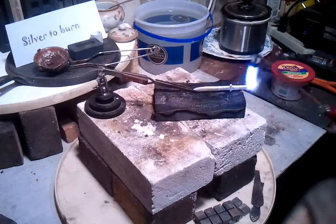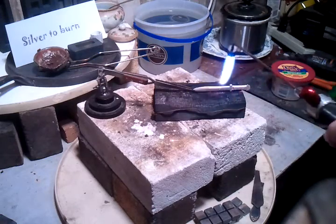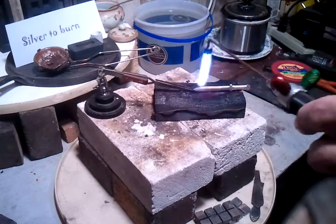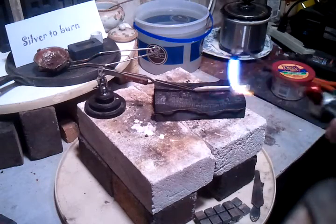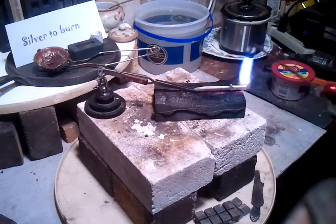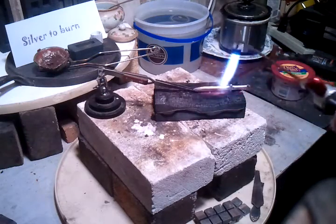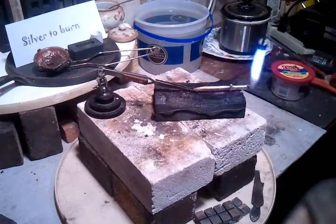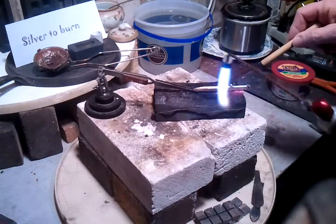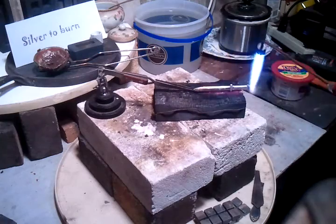Fire scale is when you get done with your piece and you have a little bit of blackness on the metal. You have to file it out to get rid of it. If you coat the whole thing in borax like that, it kind of gives it a shield over the whole piece. It's also the flux for right down in here. So right now I'm heating up the whole piece nice and evenly.